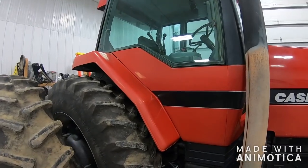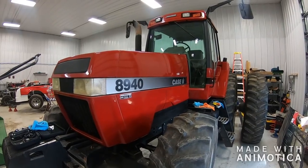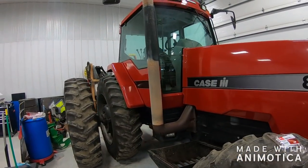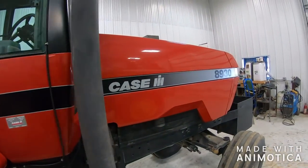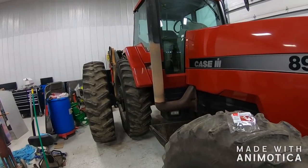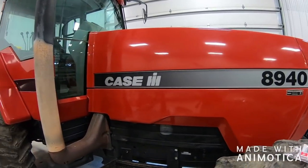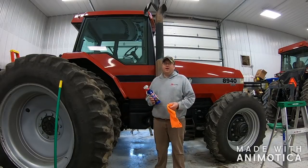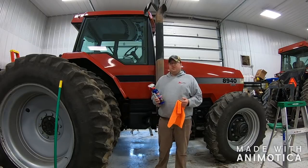You can definitely see the difference. Here's the back here. More elbow grease. Almost done. Here it is, all shined up. Looking just like this tractor now. Funny what a little bit of pressure washing and a bit of elbow grease will get you. The final step in the process after you use that rejuvenator is you have to apply a wax. Otherwise that paint is just going to fade again in the next couple of years, so you need to wax it up. You need to wax it almost every year to keep things looking nice.